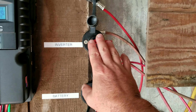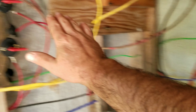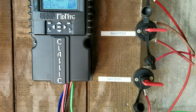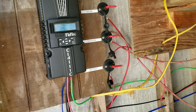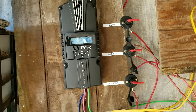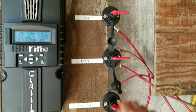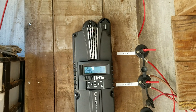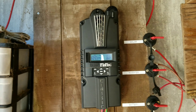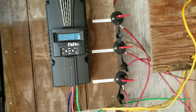All the old stuff here — we're going to tear all that out. This whole board is gone, that stuff gone, all that extra wiring gone, because we've got everything wired up really nicely now. I didn't have any shrink wrap so I used electrical tape, wound it really tight a couple of times on every terminal. We also have a ground wire connected to the charge controller — the green is ground. All the negatives from the battery and from the inverter run as a straight line, and we always put the disconnects and breakers in between the positive lines.